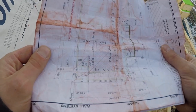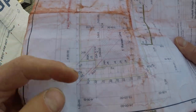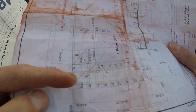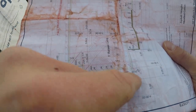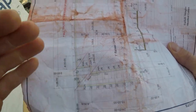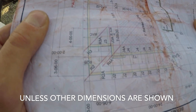So let's check it out. We're doing these trusses down here — the J2s, the R2 hip. Something you got to know is the R2B; that's how you're going to find the start of your layout. You want to measure the bottom on the R2B and it's going to tell you where to start your two-foot layout for the whole thing, pretty much except for the ones coming from the other side. The reason it's going to be a two-foot layout is because if you ever got a hip going, it's got to climb up incrementally in those two-foot increments. Anyways, let's find the R2B.